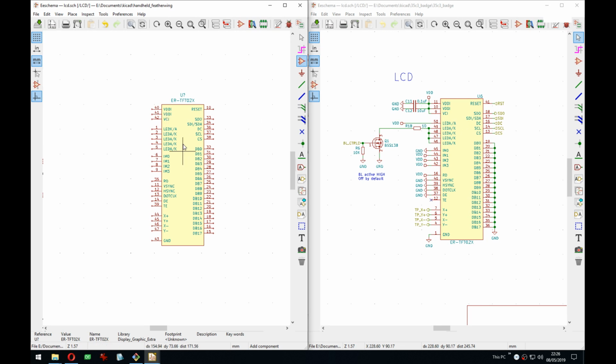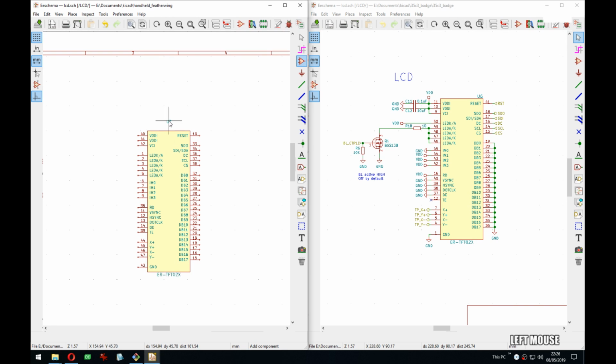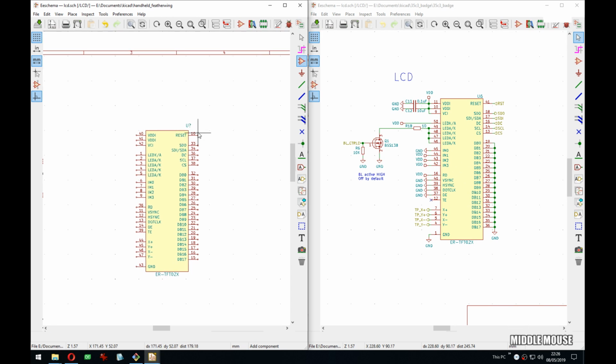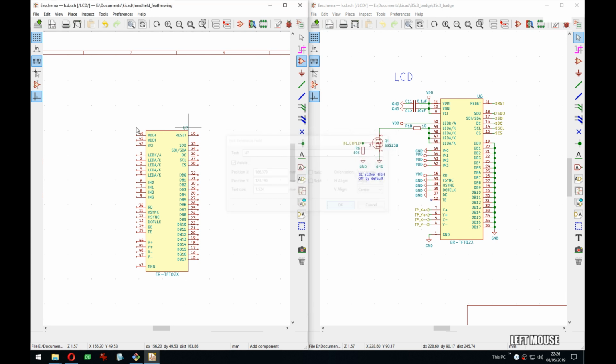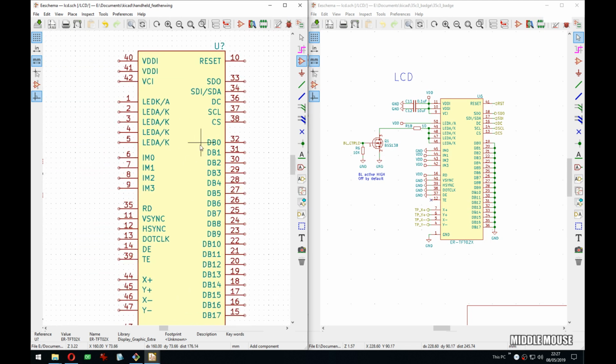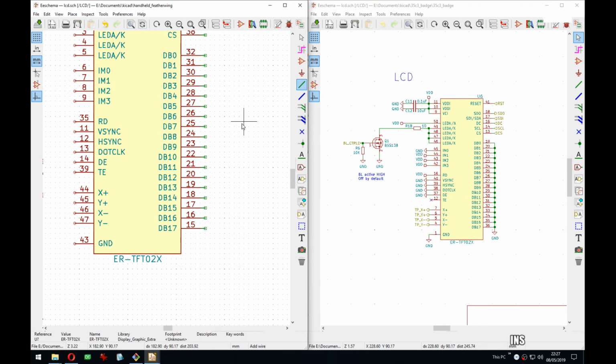Now you can see it's different, because if it's on the front as opposed to the back, then the flex is reversed 180 and all the pins, like 1 becomes 50 and all that. So later I can double check, this is a Git repo, so I can easily check out an older revision and double check that I did the connections correctly. But for now, let's just connect the way this is. I don't think it should be a problem. Look at all these grounds here.